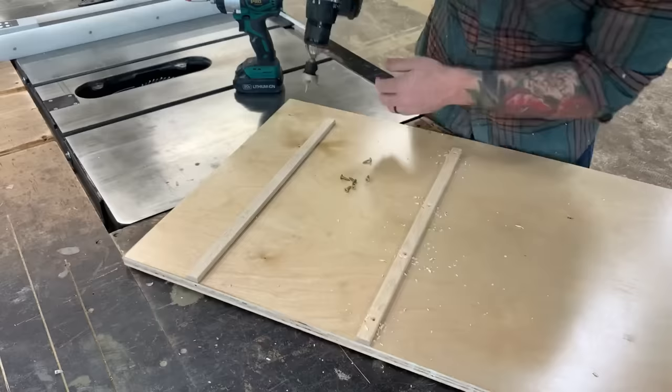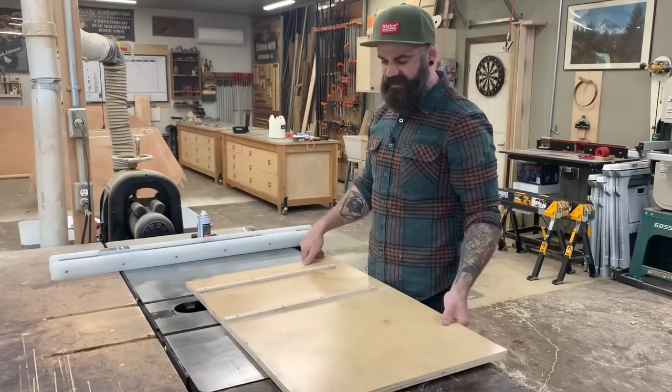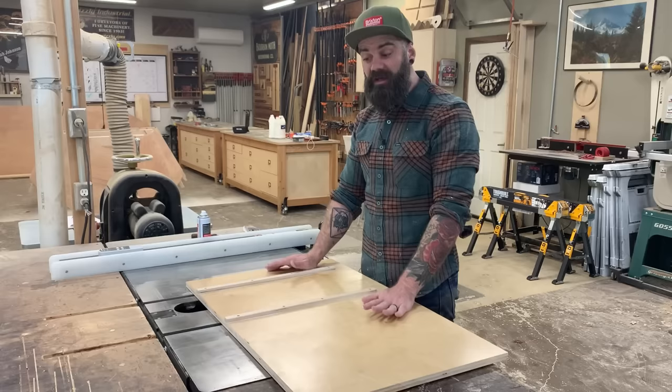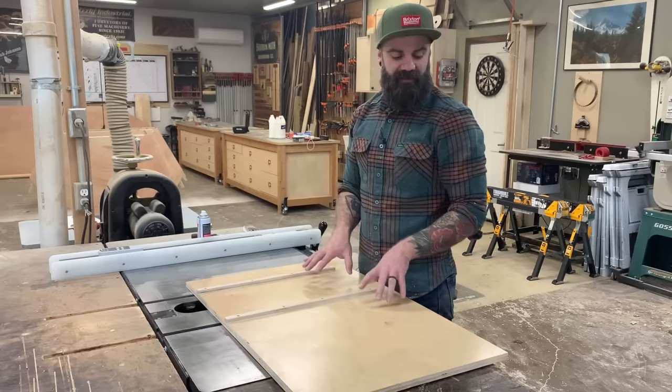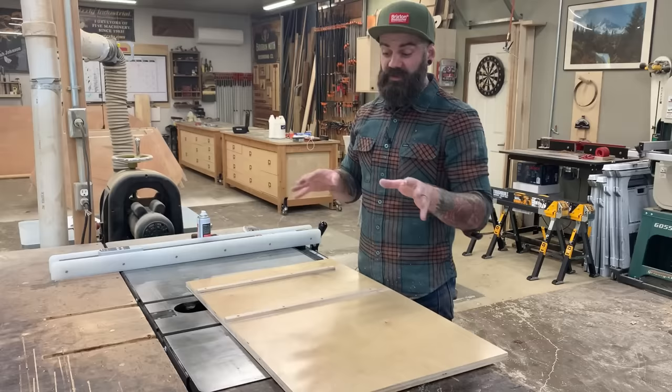Then I brought my fence over until it was the distance I wanted from the blade — for this I did 12 inches. I added some CA glue to the top of each one of those hard maple miter slot guides, then I applied some accelerator spray onto the base piece of the sled. Making sure that base piece was firm and flush against my fence, I just laid it down and pressed until the glue was dry. After a few minutes I flipped it over and my miter slot guides were securely fastened — well, not really securely. With the pre-finished ply I wasn't confident they'd stay put, so I drilled a few countersunk holes through each guide and added some three-quarter inch screws to make sure they stayed exactly where I wanted them.